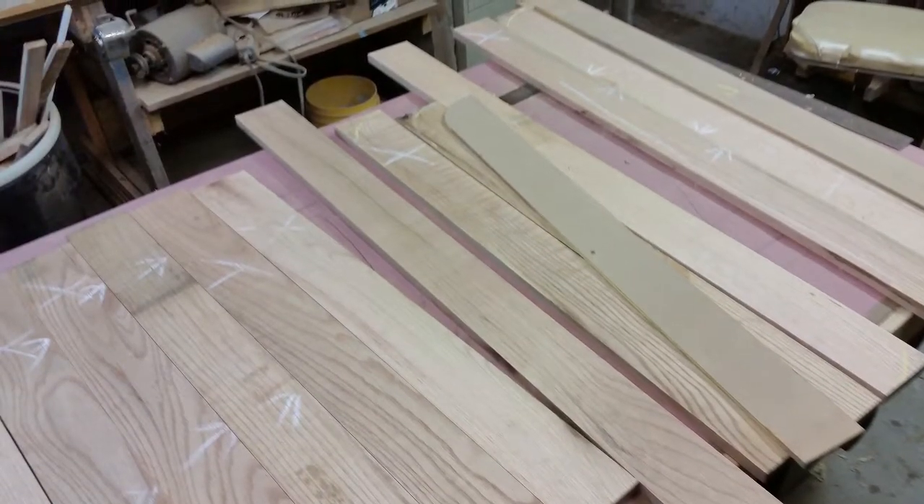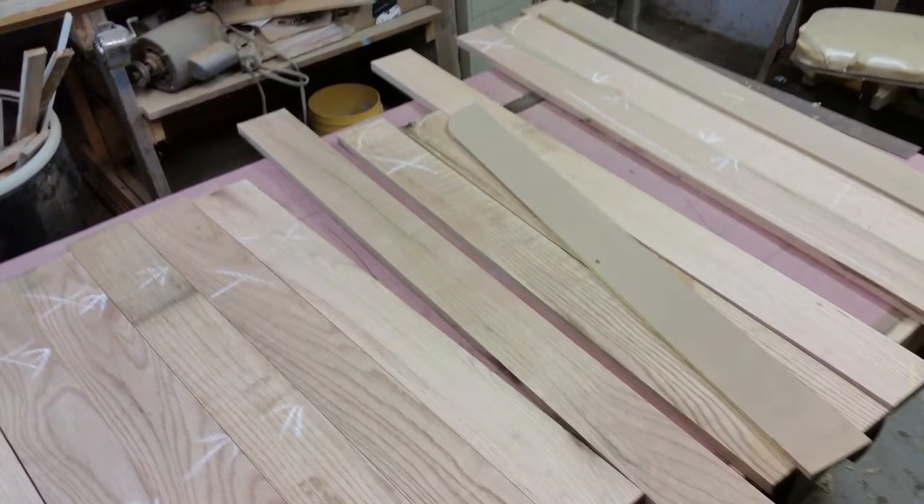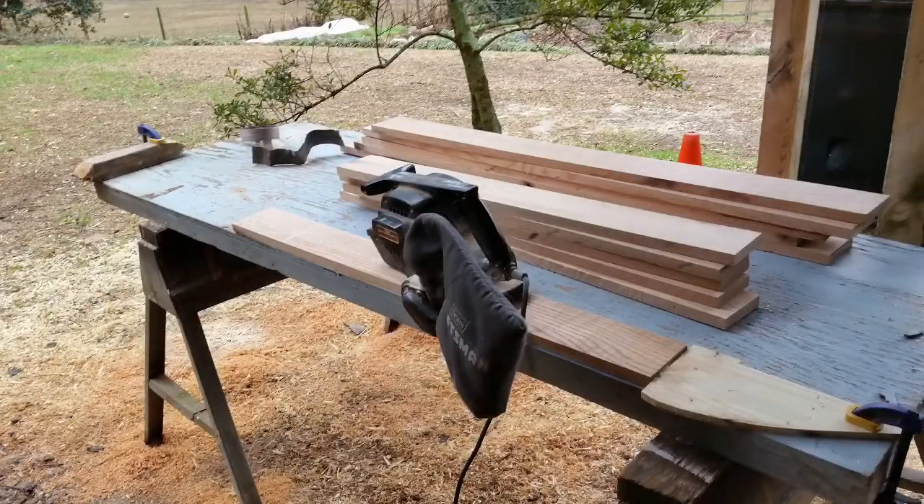The X's and the arrows here are for me to indicate which side needed to be sanded and which side had been jointed. I took it back outside and sanded it a little bit more. I have a full-size pattern on my bench on the inside and I made a full-size template to make sure that both sides matched when the whole thing was put together.